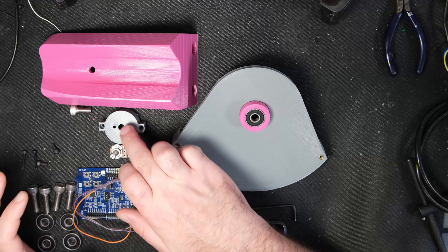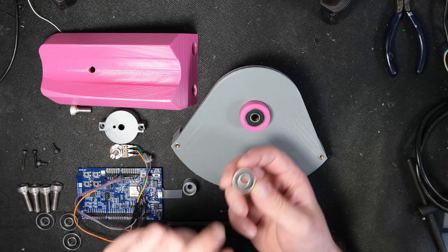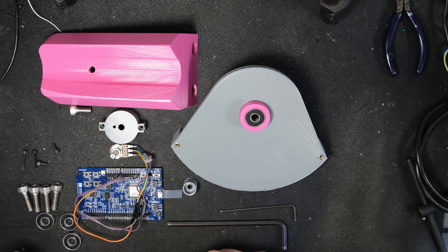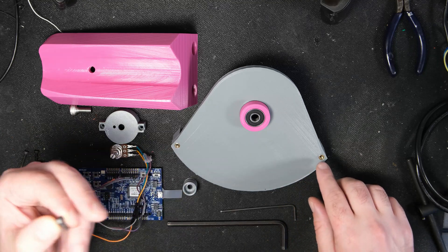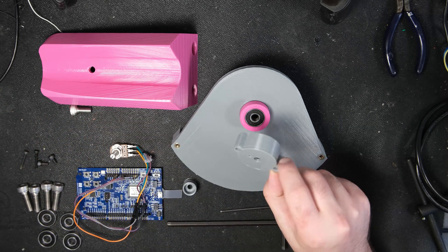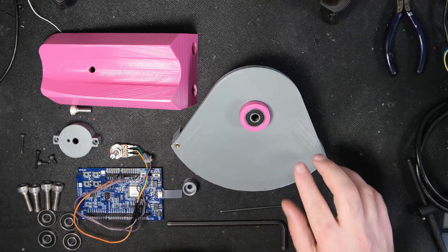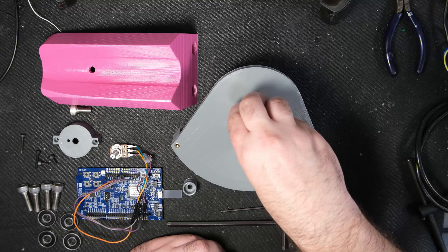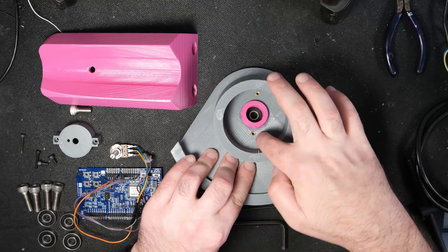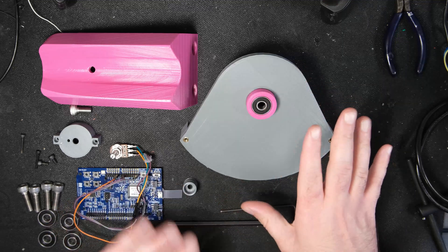There are five things to be 3D printed. You're going to need some M8 by about 25mm bolts, some 22mm OD, 8mm ID bearings — these are 608RS. For the stops, I just used some M4 inserts and M4 by about 8mm bolts. The bottom cap holds the potentiometer and needs some 25mm M3s. There are some aspects of this design that have changed, and this is one of them. It has a system to prevent rotation, and you have to push the bearing in. The two bolt holes are now rotated, and there is a proper groove in the current design. So if you 3D print it now, it should be much better than what I've actually built here.